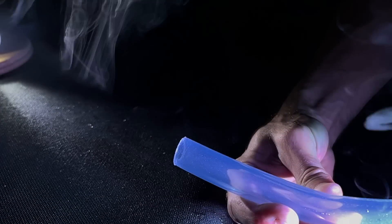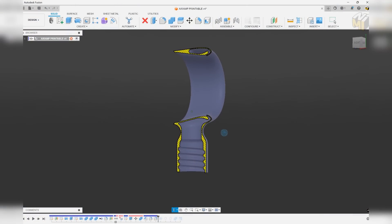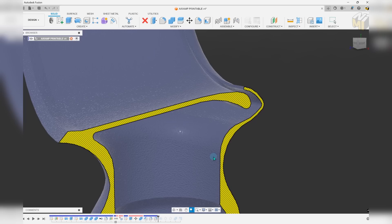At high speed we can see that the tube is able to pull some air in from all around. The amplified design that Dyson created does work well to pull a lot of air in from behind; however, the overall amount of air moved is not far off from what an unrestricted pipe can do. Both options move quite a bit more air than the fan alone, and it's actually pretty impressive that even a heavily restricted design like mine performs so well. I'm not sure I can reach 15 times the air, but with some adjustment it can probably be made quite a bit better — possibly even twice what I've created. I've linked my version below if you want to download and tweak the design.